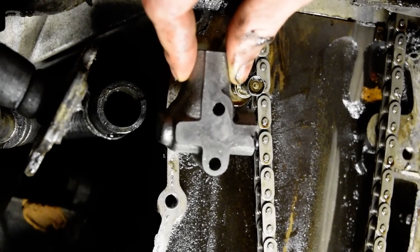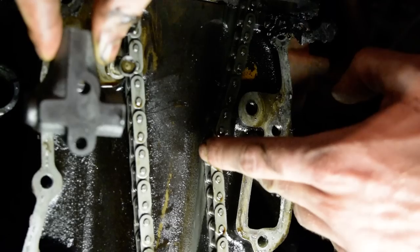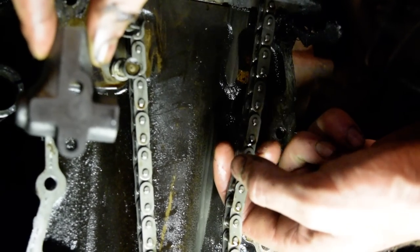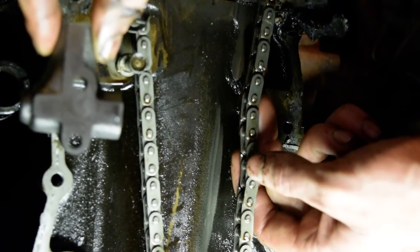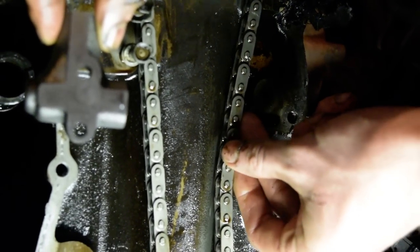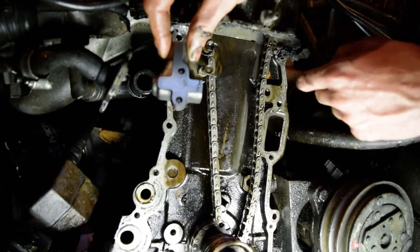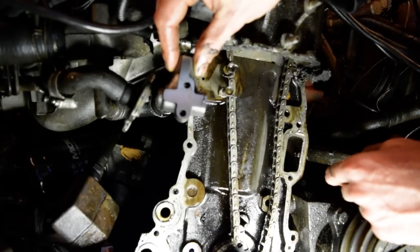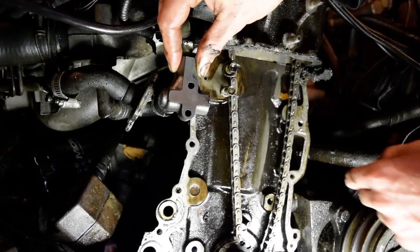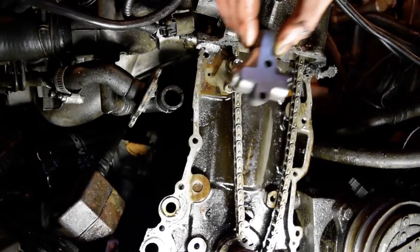That's what messes them up, and the slap is on this side. You have a guide on this side with a channel — a straight guide with a plastic channel. If that channel gets busted off with that slap, it'll rub. See where it's been rubbing right here? And this happens within just no time. All right, let's show them what we've done for a modification — for a fix.